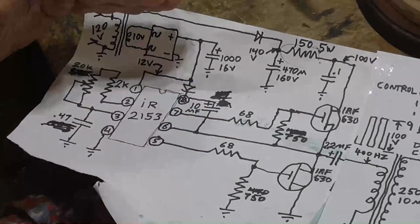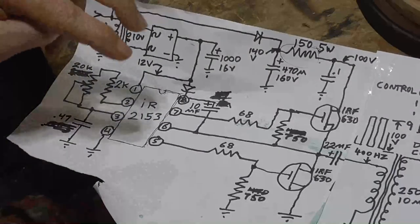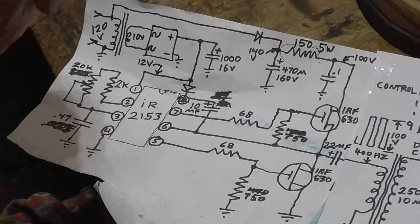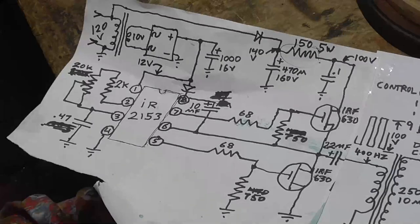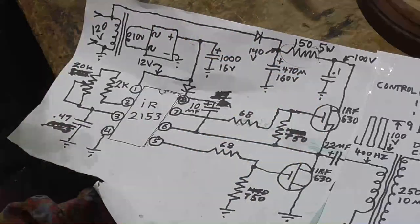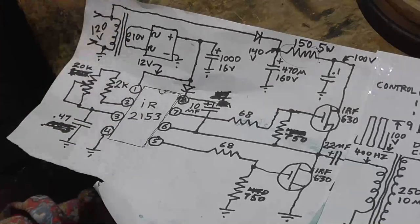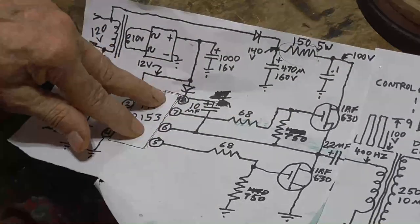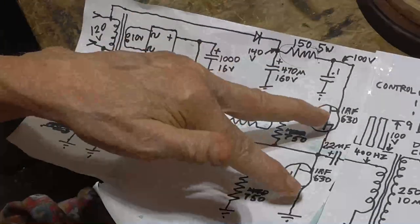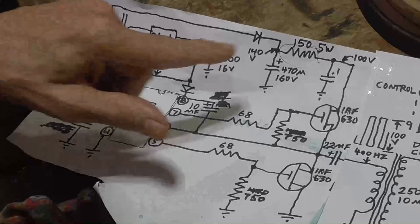And that makes it so that when you first turn the power on, this device supposedly maintains both outputs at zero until the power comes up. That does not always hold true if you have a separate supply onto the FETs from the 2153. If this power can come up before the IC gets its power and turns on, then these two gates can float, and they may be on at the same time, and you'll have a momentary short that can severely heat this up.